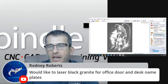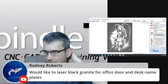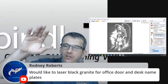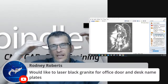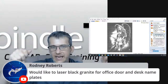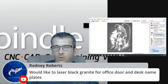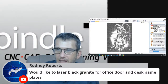Someone would like to laser black granite for office doors, desk names and plates. Laser engraving granite is a different process. I'm not sure how much power is needed. If somebody has one of our 6-watt lasers and has laser engraved granite with it, let me know, because I've never done it. But usually it's a 60 or 90 watt laser for engraving granite, like headstones, tombstones, office door plaques and name plates. It's absolutely doable, but the wattage needs to be higher than a 4 or 6 watt laser. You're going to need your 40, 50, 60, up to 90 watt lasers for that, Rodney.